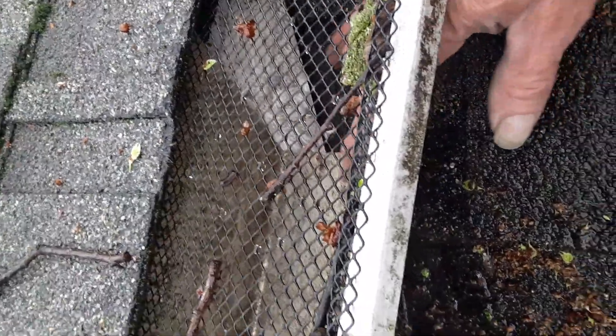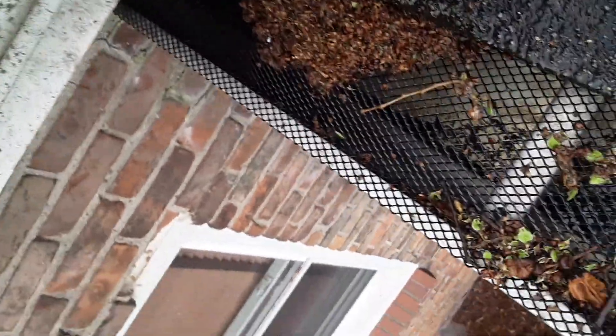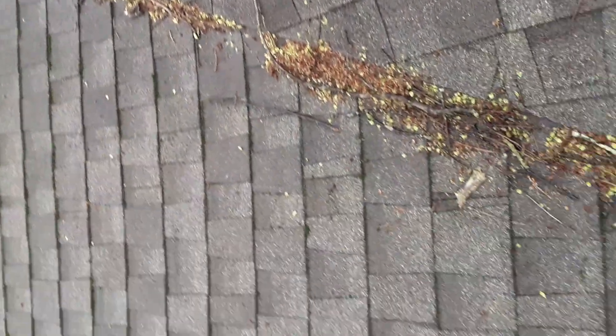This isn't the way to dump a gutter onto a roof. It's supposed to have a piece of metal here to shed the water down so it doesn't wear the shingle right out. This is a pretty new roof right here — there's no sign of granules worn away anywhere except for here where it's getting dumped on by this water.